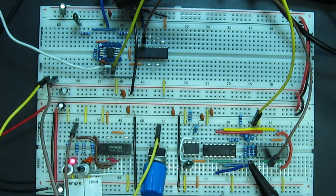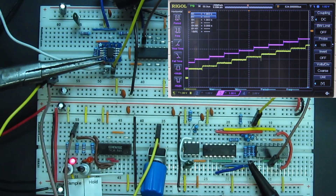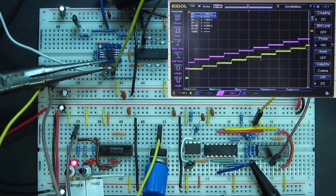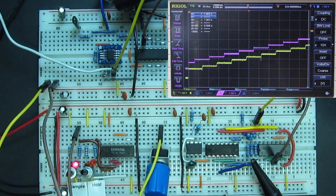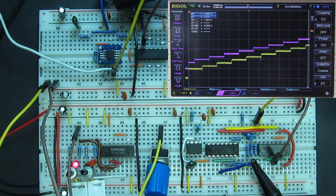Now I'm curious — can we make do without slowing the op-amp down? Is the extra compensation still needed? It appears not. The output is nearly as clean without it, maybe even cleaner. This looks like a pretty workable setup for audio speeds, at least. The glitches that are coming off the R2R ladder are gone in the output. We've converted the glitchy stair step into a much cleaner one.